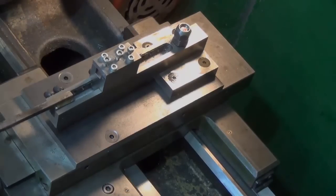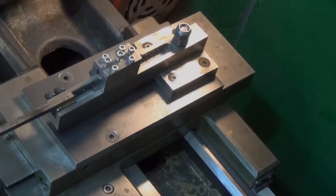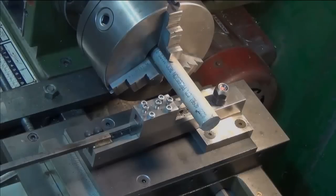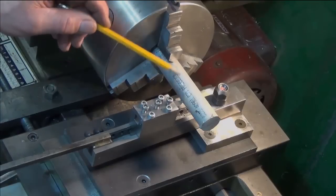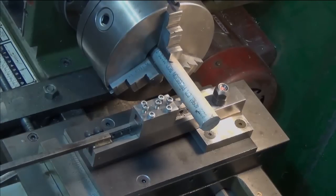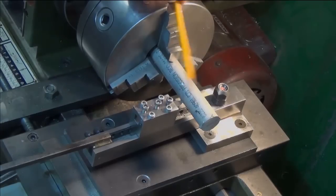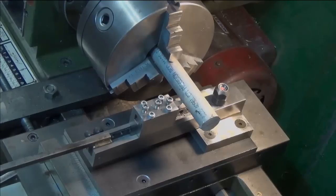I've tried this out and it has cut cones quite nicely on the lathe so far. I've set the lathe up just like the drawing that I showed you at the start of this video. I have a carriage stop here. My cutter can only come up to one and five-eighths inches, plus a little bit for the rough edge. I do have the two and a half inch radius that I want.